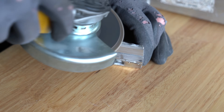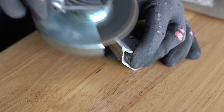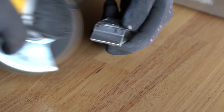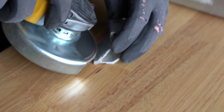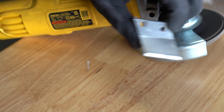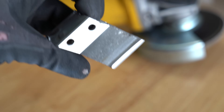On to the chain thingy, whatever this is called anyway. It is anodized just the same as the swing arm is, so that has to go. And whatever little tiny bit of weld we have on here, that also has to go. We need to get it back to a bright finish in order for the weld to take and to leave the ultimate strength on here. This is very, very light work done by hand — more like a sweeping action just to remove that top coat or that anodizing. If you don't get it out of there, you're going to see some junk start to float up inside of your weld, or it's almost like an impenetrable peel coat. You've got to blast the crap out of it just to get rid of the anodizing, so try to get as much of it off as you can when you're using the flap disc.